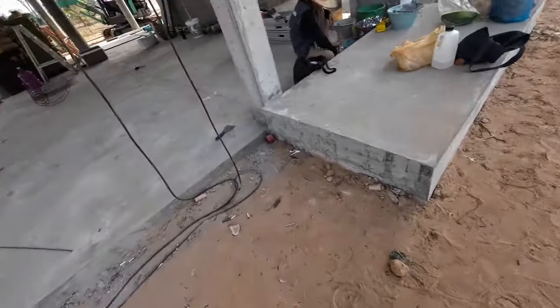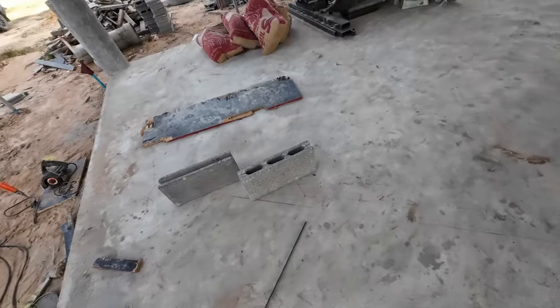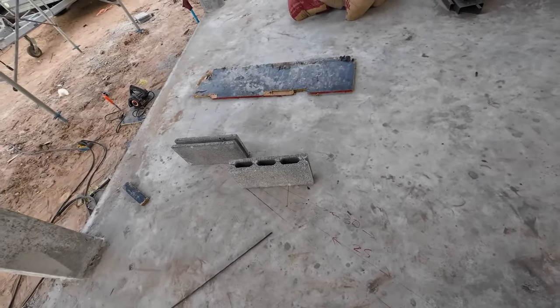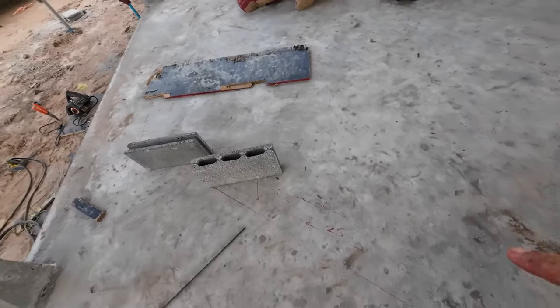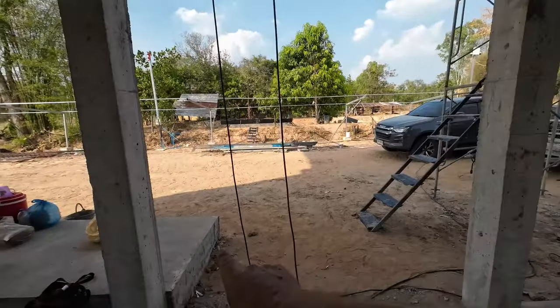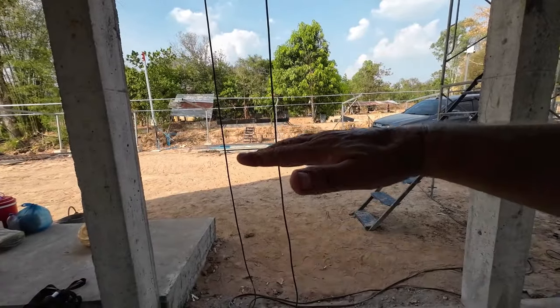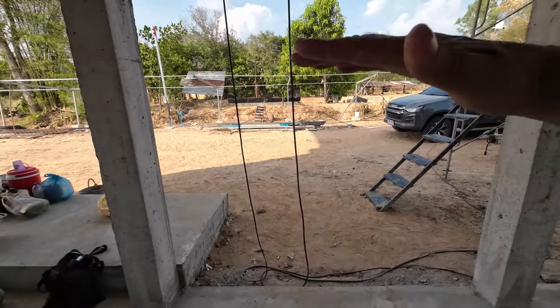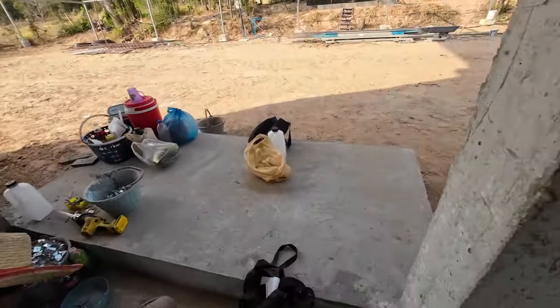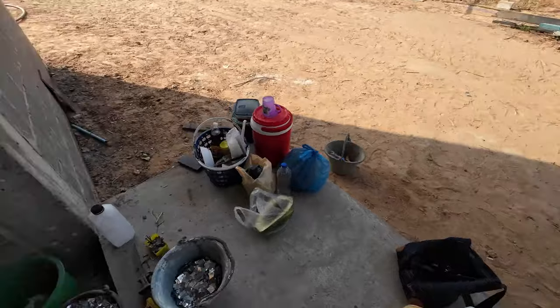So I'm going to go back tonight and do the design on that. So yeah, anyway, you definitely want 30 wide steps, because we've done the angles, check the angles. And the problem we had is from there to there, in the drawing the steps are 25 centimeter high, but you want it more comfortable, which is 18, which that's 18 there. So when you walk up, it's actually quite comfortable.